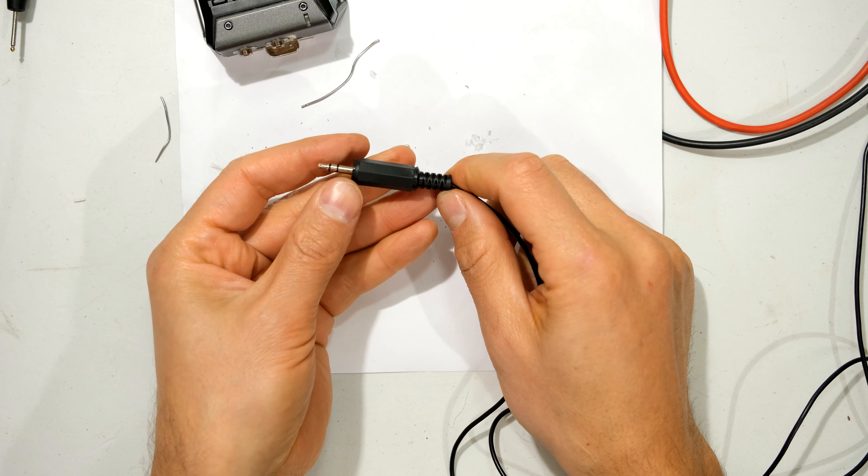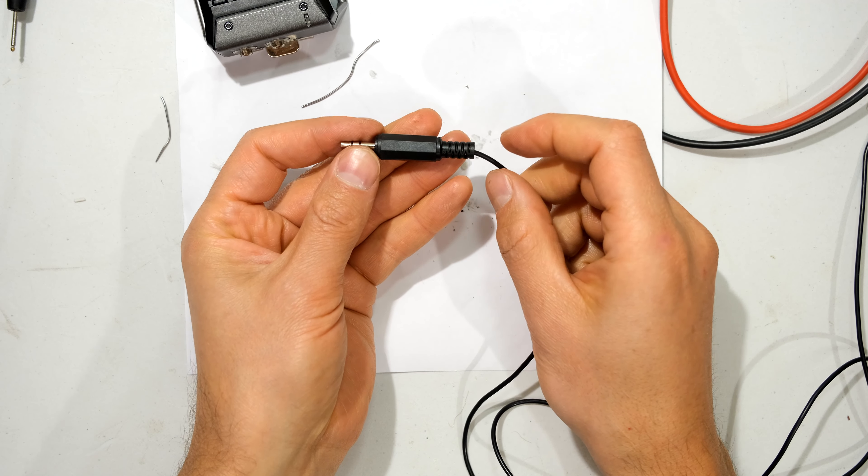In this case, you can see that the connector I've used has quite a big strain relief and the cable is thin. Try to get one that is quite snug here. You might want to also use heat shrink to make it tighter where the strain relief is. If you'd like to see how to reuse the Zoom F1 connector, I have a video explaining how to reuse it, make your own strain relief, and also how to troubleshoot the wire. Maybe there's a fault in another part of the wire — the link to that video is under the description in this video. Thanks for watching and cheers.